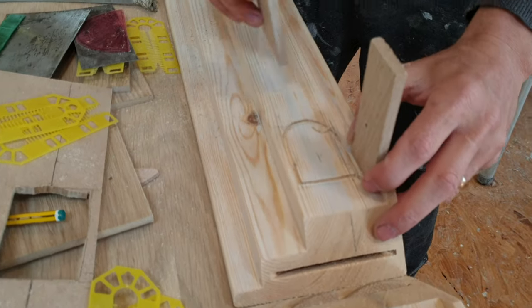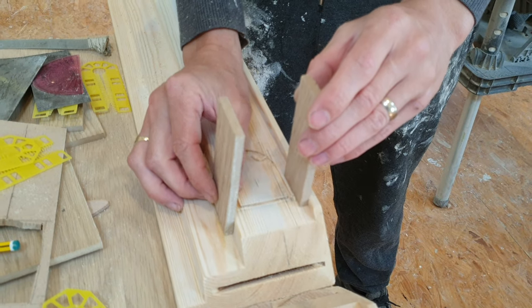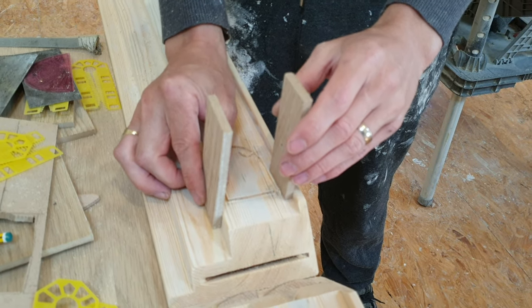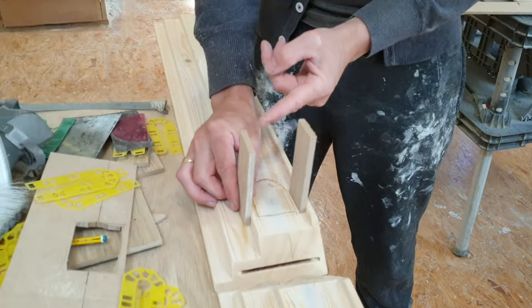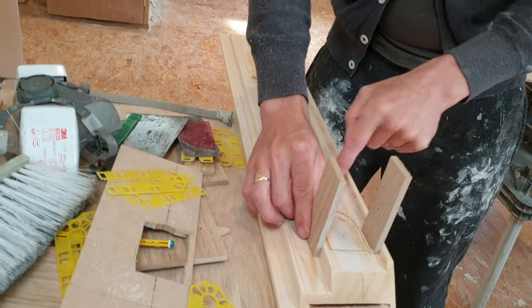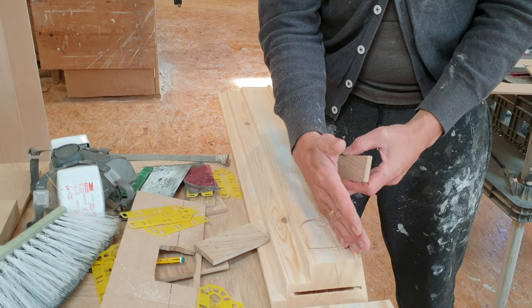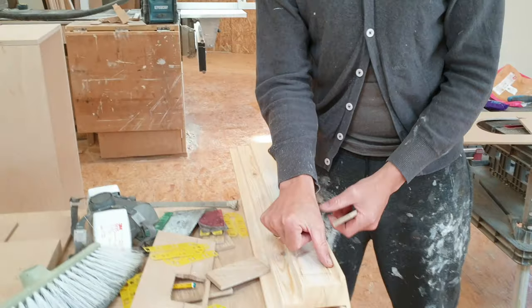Imagine the glass is going there. The front of the frame — the middle backing, I call it — is going to be made out of birch and it's going to have CNC letters in it. Light shines through the letters from this part. There's 4mm glass going up against this, which is why this margin is slightly bigger than the other margin — by the time I get the glass in, I want it to still look centred.